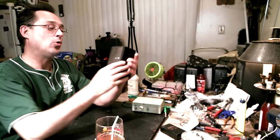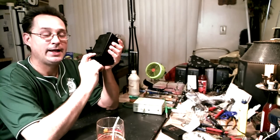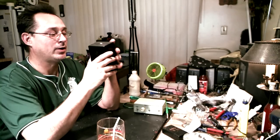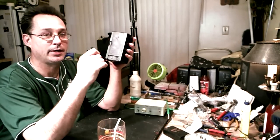Welcome back to the kitchen. Today I wanted to share a stupid little hack. I'm really cheap and I love going to Goodwill and Salvation Army. I picked up a pair of these old Realistic mini speakers - they've got 4 C batteries in each one, a 6-volt DC wall bar jack, and an eighth-inch audio input. What I did for this one: I completely removed and unsoldered the audio input because it's a switching jack. When you plug the input in, it turns the batteries in the circuit on, and when you unplug it, it shuts the batteries off to save them. I removed that and ran the wires up to a quarter-inch jack.